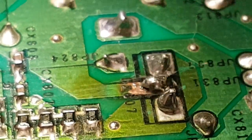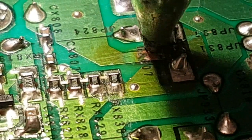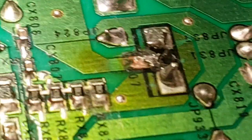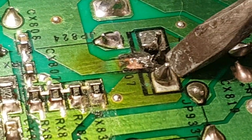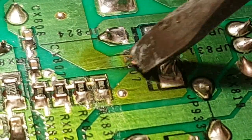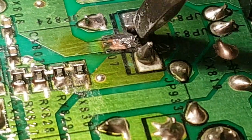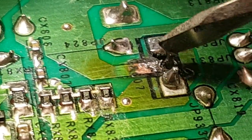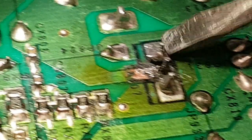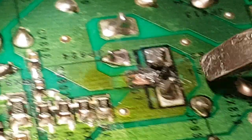The proper way to fix this, once it starts circling around, is to suck out the solder as it should have been done. Originally this track was going around the leg, but because the design is so bad, the copper on this side has disappeared. Whoever repaired it just did a blotch of solder — like here and here — and that's the wrong way. The right way is to clean the leg on both sides, then bend the leg to provide a lot of surface area for contact with the track on the back.